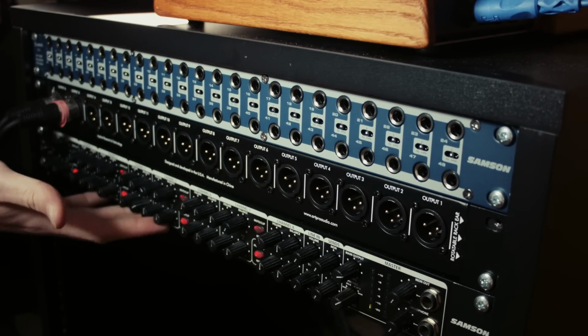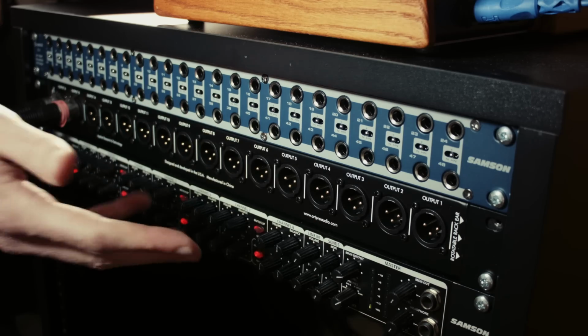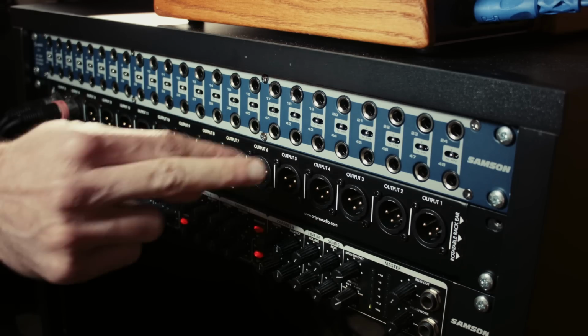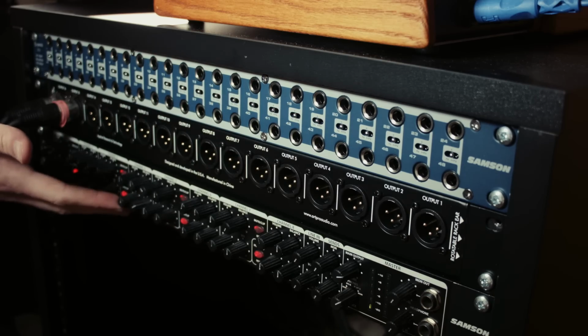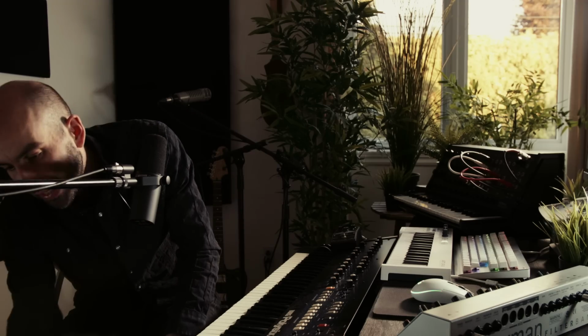And then finally, we have a line mixer here, which just has a bunch of different channels in the back. And then those get mixed together, obviously, here. And then the two outputs of this mixer, I plugged into my 1/4 inch patch bay here. What this allows me to do is create kind of a secondary mix bus of random things I want to combine together and have those available in the patch bay here as if they were normal instruments.